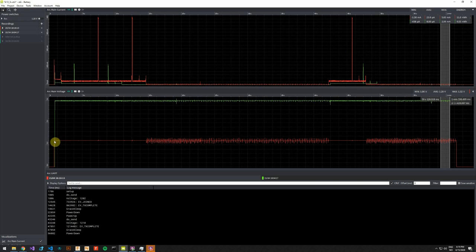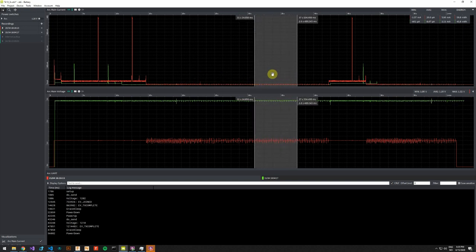We can evidently see that the power source, or the voltage, was much lower in this example. We can also see some evidence that the switching power regulator is working much harder in this case. And when we look at the current consumption, it is much higher. We can just select one area. Now, it did complete the transmission and join a bit later in this second run, so I'll try to find an area where the graphs are already synced, or else I would have to adjust them.